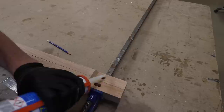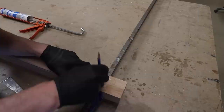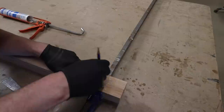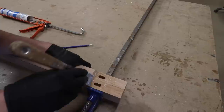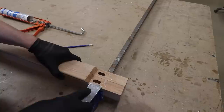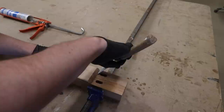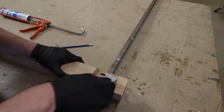I've seen joinery leave the workshop where I used to work glued up with Cascamite. The joints would be cracked before they'd left the workshop, and it's just not good, really. That glue's soaked up the end grain, there's not really a lot of strength in it after it's soaked up the end grain and left a weak joint. Whereas with this stuff, if you put a thickish coating on the end grain, it does soak up, but because it's quite a viscous consistency anyway, it doesn't go ridiculously soaked into the end grain and completely disappear. And by the time it's soaked up enough to disappear, if it was going to, it's started to foam anyway and expand. You've physically got some glue there to glue the joint together, so I think you get a much stronger joint with the PU than you would with Cascamite in a situation like this.